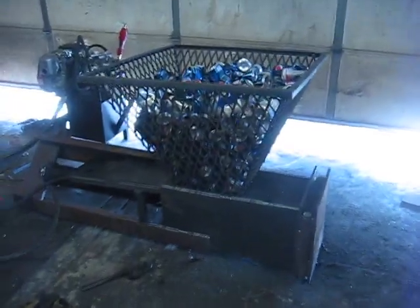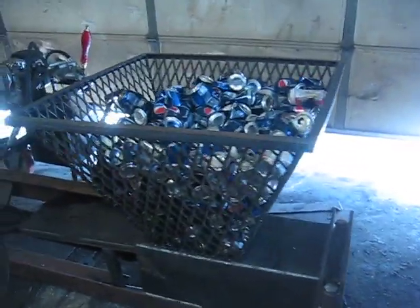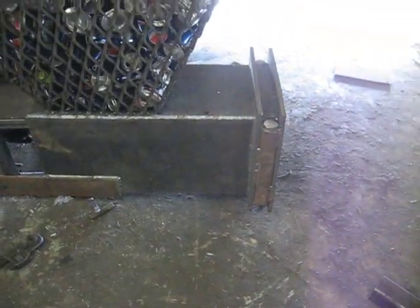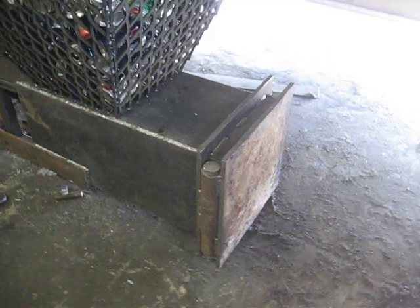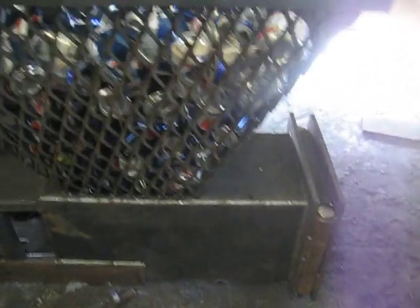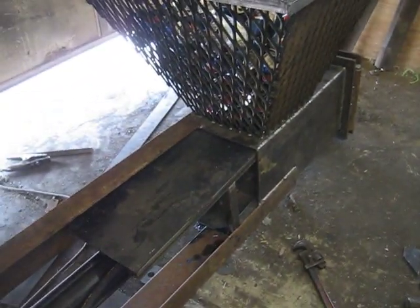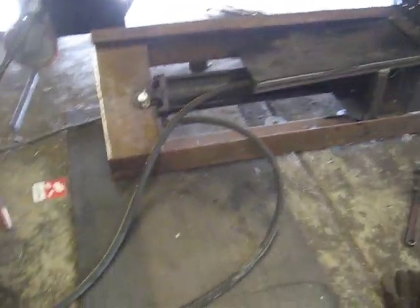You're looking at 250 cans in a hopper. It's got a little one-foot by one-foot chamber down there, sealed off with a half-inch plate and inch-and-a-half pins. It's got a door in there so they don't fall back behind — when it rams all the way back it only allows them to fall in. It's got a four-inch bore ram underneath there, with a 24-inch stroke.